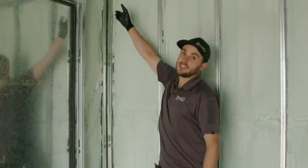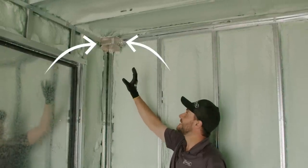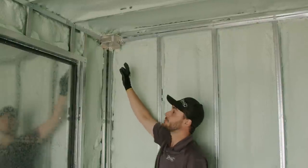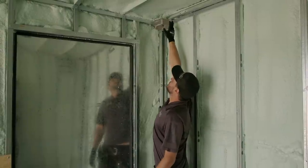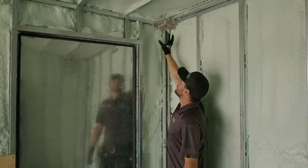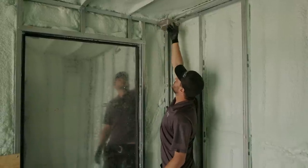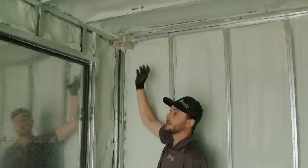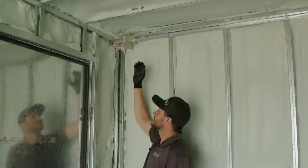This here is very new to us — we call them inside corner casting covers. You can see what it looks like after spray foam. We like to install these prior to spray foam — it connects the vertical corner studs to the top track on the ceiling and a top stud going across. We would otherwise have to finish the ceiling to a lower height because we can't get two inches of foam around that corner casting. But because of this, we're able to gain an extra valuable two inches of ceiling height inside this container.